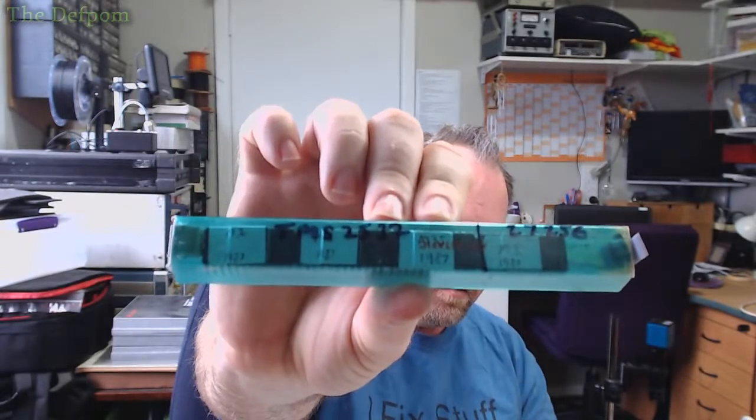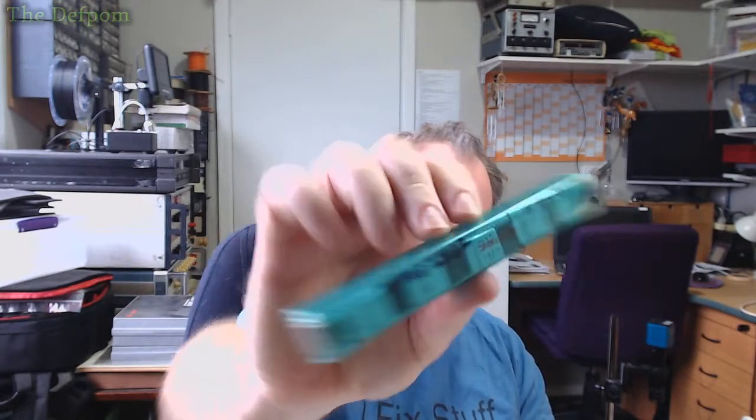And in here I've got a set of EEPROMs. Yeah, it's a full set in there, which I programmed for the Datrons. It's a 1987 firmware, which is actually slightly different. I did a comparison between the 1987 firmware, the 86 firmware, and what's in my Datrons. The 86 and what's in my Datrons, as I mentioned before, is the same. 87 is completely different. They don't actually match. So I'm not quite sure what the difference is between 1987 and 1986 in the firmware.